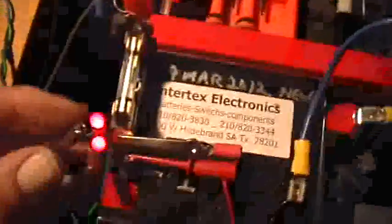Okay, and then I ran out of room at this end, so I just used an alligator clip to clip that to the negative battery or positive battery terminal right there. Okay, so now what we'll do is we'll unclip from here and clip to there. Boom, and you can see those are back-to-back LEDs, and they're both lit, and we have the oscillatory waveform still there. Those LEDs are actually lit very brightly, and if I touch stuff, adding capacitance, I change the waveform and darken the LEDs.